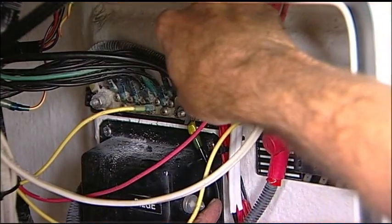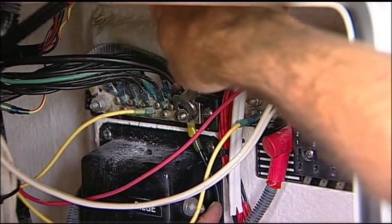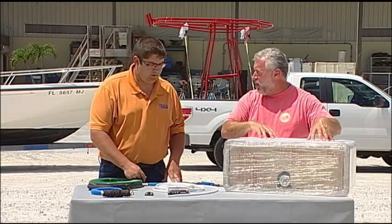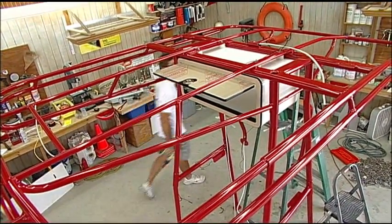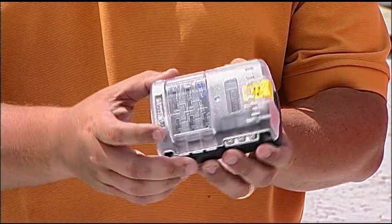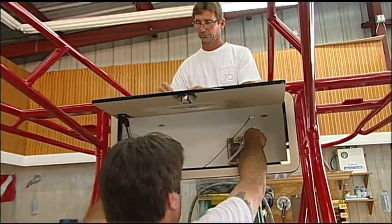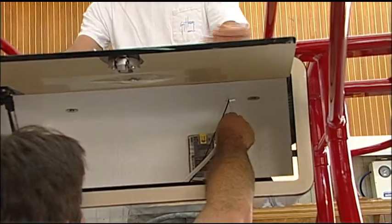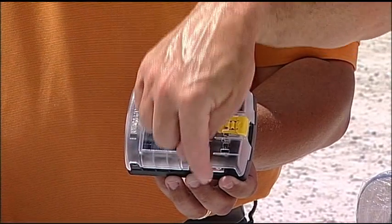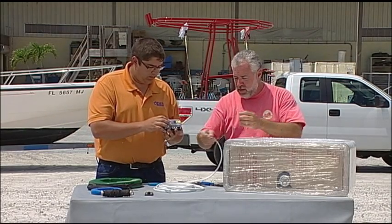So we've got the battery end taken care of. What are we going to do inside the electronics box? I want to distribute some power — marine speakers, a VHF radio, a stereo. We like to use this Blue Sea Systems fuse block, which carries your positive and your negative leads into it as well. So we're going to bring one leg in as our positive and then run it back to our negative. This is also a built-in ground block. We like to fuse any piece of equipment you put on the boat for proper protection — to protect yourself from having to replace expensive equipment when you have a surge or some sort of electrical shock.